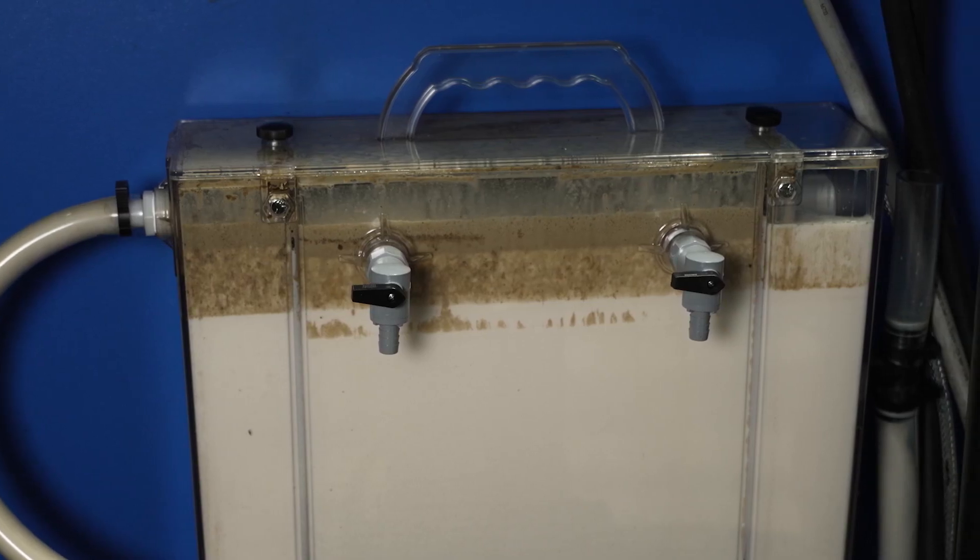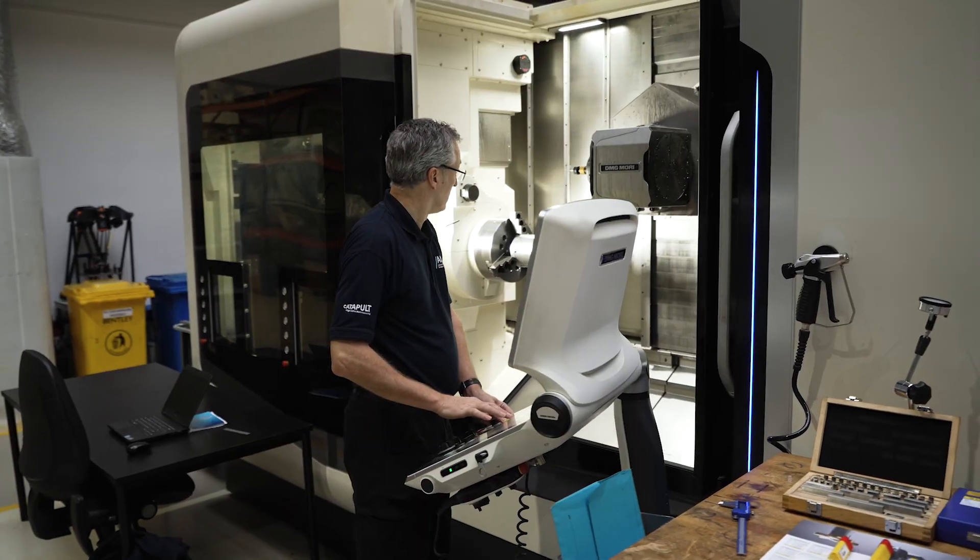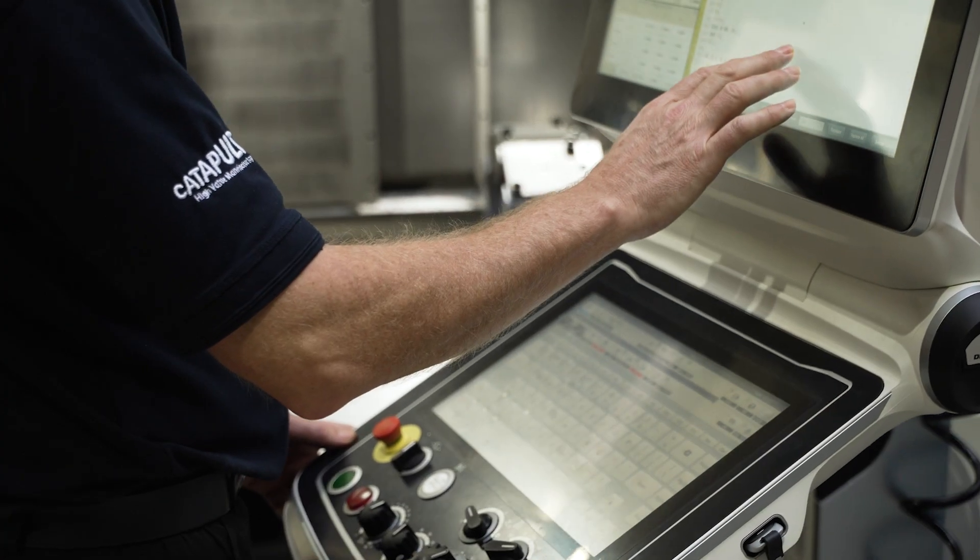There's no excuse for having high tramp oil levels. When you get rid of the tramp oil, you're really starting to get back towards what the fresh product is like when it first goes into the sump. The benefits for us are fabulous — the company makes sure that it's a safe working environment. It's important to act promptly if your tests show that tramp oil contamination is increasing. Keeping tramp oil at a minimum will maintain the quality of the fluid in your machine, which is better for you and your colleagues' health and will maintain the machining quality.